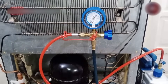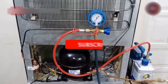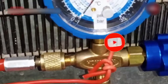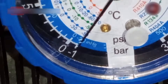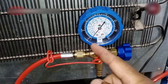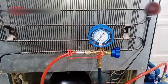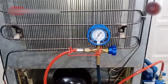Now I will crack the system with gas and then start charging refrigerant. But before cracking the system and filling the refrigerant in the refrigerator, we left the system for 20 minutes to know whether there was leakage in the fridge or not. The needle of the gauge is standing in the same position. If the needle starts moving upwards, it means the fridge has leakage. But if there is no such thing happening on the gauge, it means the system is fine and ready for gas charging.